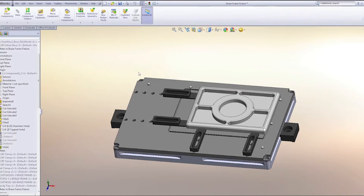Here is the fixture that I've got planned out for these plates. One of the advantages we're going to have by doing it this way is I can walk around the part with an end mill and access half of its thickness all the way around, all of the top side, and I have full support underneath the material. So it's held down tightly and it's rigid, which is going to allow me to machine it a little bit more aggressively than I would if I was holding it in a vise — because in a vise I would have to hold it so delicately. I did try that two different times and was able to make a part, but I had to barely tighten the vise and just cross my fingers that it didn't lift. The other issue is at the bottom of the pockets it's pretty thin and there's a really good chance you're going to get chatter. Doing it this way, the part is flat and supported on the bottom side where it's thin, so it should reduce or completely eliminate the chances of chatter and I should get a nice surface finish.